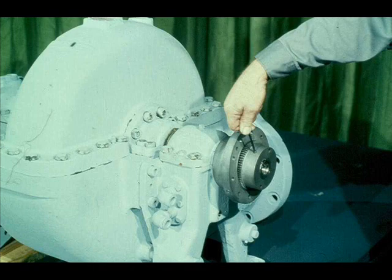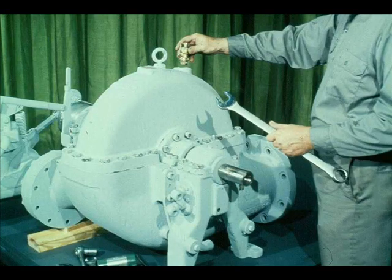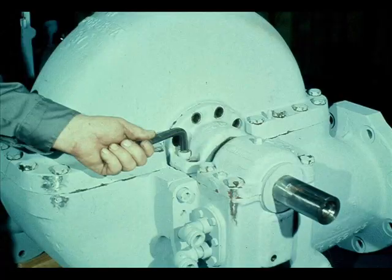To remove the coupling from the shaft, you must first loosen the set screw. Then attach a puller to the coupling and remove it from the shaft, taking special care not to damage the shaft center during the process. Before going any further with the disassembly, remove the sentinel valve from the turbine and arrange to have it inspected, repaired, and reset if necessary. The next step should be to match mark parts of the turbine so they will be reassembled correctly. This would include bearing caps, packing housings, and even the turbine case cover. If you have any doubts, match mark it.